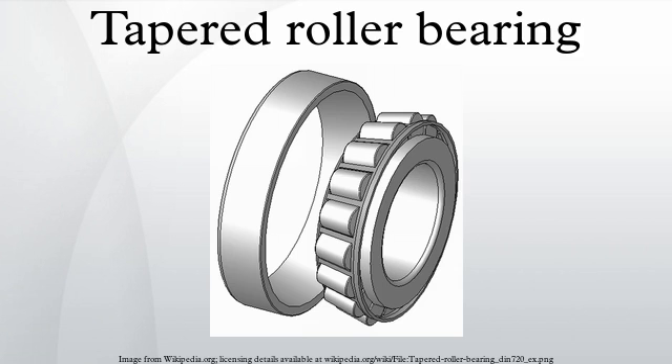This geometry makes the motion of the cones remain coaxial, eliminating sliding motion in the bearing. This conical geometry is used as it gives a larger contact patch, which permits greater loads to be carried than with spherical bearings, while the geometry means that the tangential speeds of the surfaces of each of the rollers are the same as their raceways along the whole length of the contact patch, and no differential scrubbing occurs.